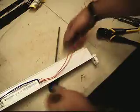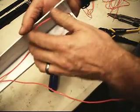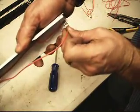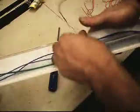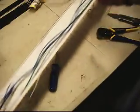Going to bring it back up here. Same thing. Stick your leads into the tombstone bottom. Just fold them back to themselves. Alright, so I'm all set up, got my ballast back in, got my hard wires to go up. Going to put it all back together, wired in the housing. From this point it should be fine, but that's just how you install the new ballast into the tombstones, extracting the wires from the tombstones and get you up and going again.